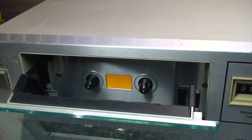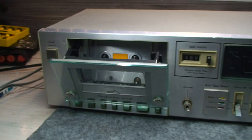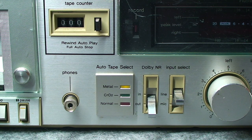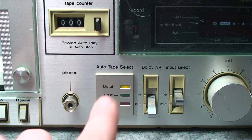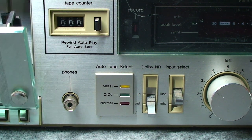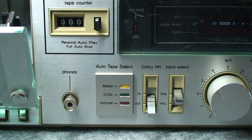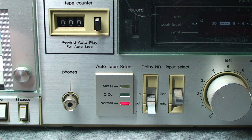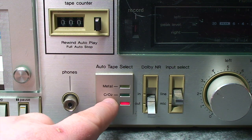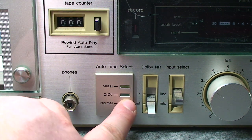It always made this kind of typewriter sewing machine sound in the background just sitting here idly. If I'm quiet for just a moment, you can probably hear that sewing machine sound. And with no cassette tape actually inserted in the deck, you can see that it defaults to metal, which lights up yellow. Then I go to eject it and play this normal bias type one tape, and that switches automatically over to indicating that it's a normal tape. I don't have a chrome tape on hand, but if I were to insert it, this would light up green.